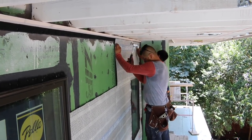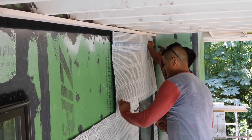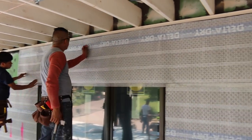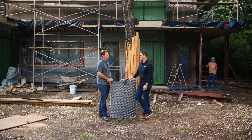We've talked about the benefit of doing it with all claddings for years, but it's even more important with what you're terming an absorptive cladding. This stucco is like a sidewalk on the side of our house — a big sponge absorbing all that water — and we want that air gap behind it. How are you achieving that air gap? What's the process you're using?